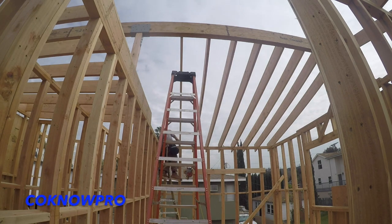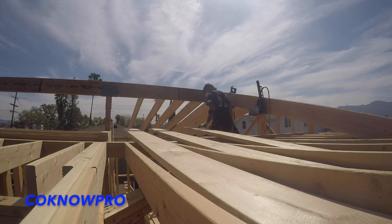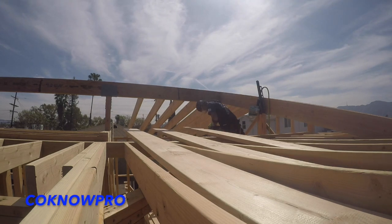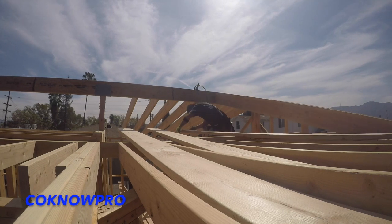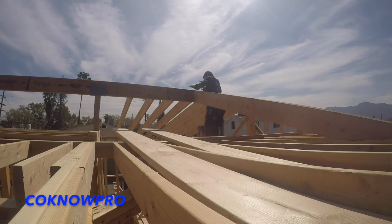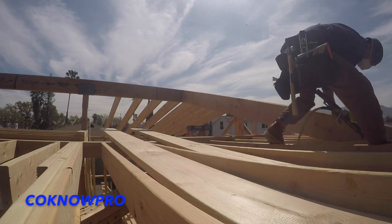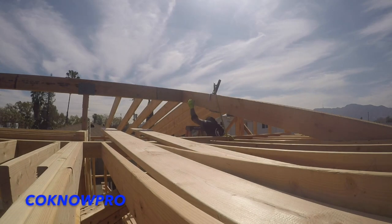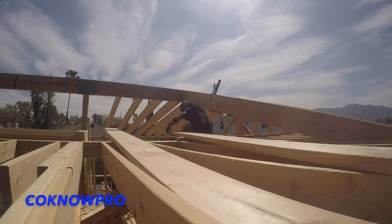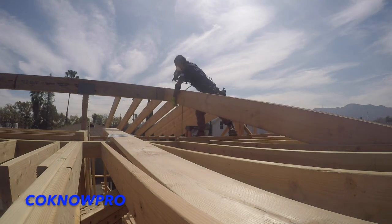We're also measuring out 11 inches on the end of the rafter tail and giving a plumb-level cut with the skill saw right there to give it a 12-inch face once the fascia is installed. You can see how the right-side gable is about 3/8 inch shorter than the left-side gable, which is fine. I just bring my rafters up pre-cut to the other side, bring my skill saw up, and fit them all per 16 inches so it's all nice — the framing is tight and looks great.